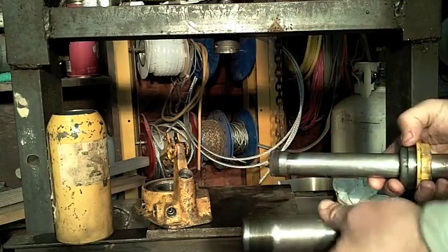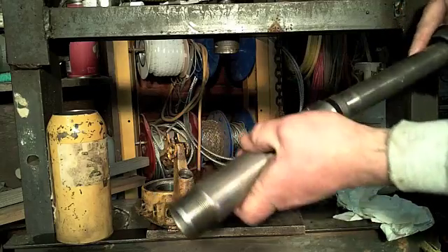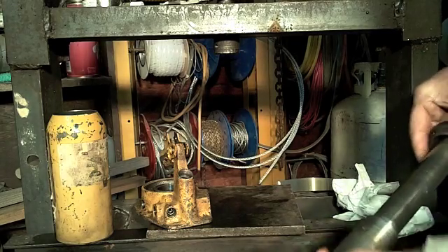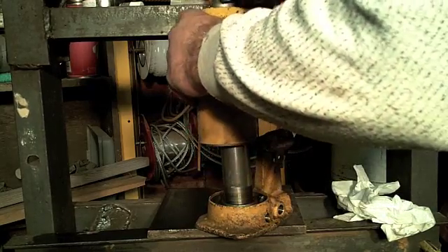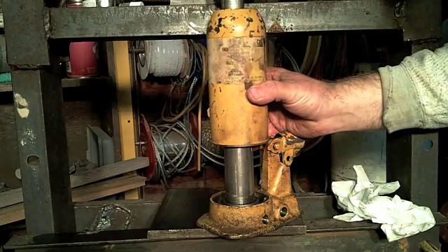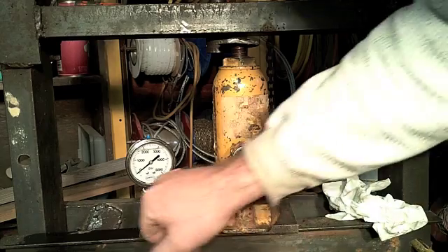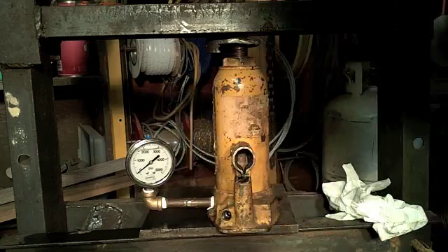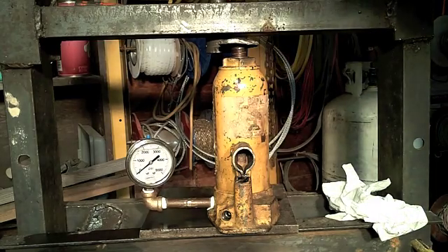Reassemble the jack the way you took it apart. It's a good idea before you reattach the piston to put a little oil on that seal. You know how tight it was when you took it apart — it's got to be pretty tight when you put it back together. And there it is, all complete. I just need to refill the bottle. It might take some time and effort to get it to properly bleed. Remember, this is hydraulic stuff, so there can be quite a bit of pressure on it, and water pipe might not hold. You should look into using the proper stuff. I'm going to go ahead and bleed this and then test it out. I hope you have good luck with your own jack, and thanks for watching.